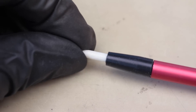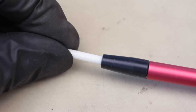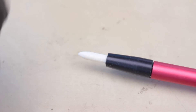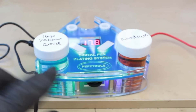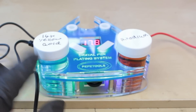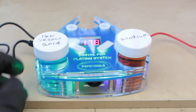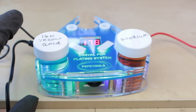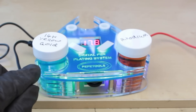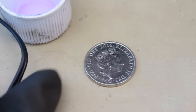To get started, put your felt nozzle into the end of the pen and make sure it's all the way in — that's very important. Make sure you use gloves or plastic tweezers; you don't want greasy fingerprints on the nib because that will stop it working. The color of the solution does not necessarily correspond to the color of the plating, so keep everything well labeled, don't swap caps, and keep solutions separate. Also, just put a little bit of solution into the small jars to avoid contaminating your bigger bottles.